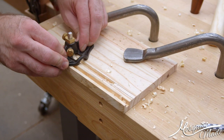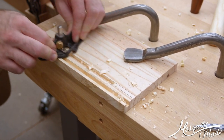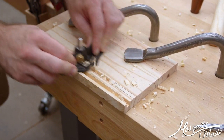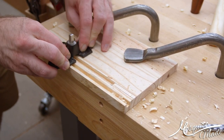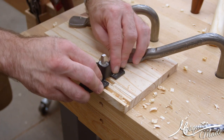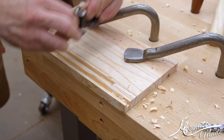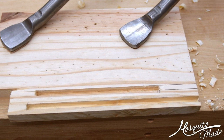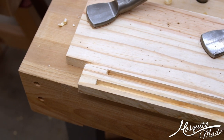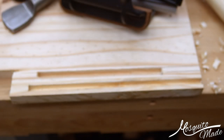Because you're cutting down into both ends, there's going to be a little hump in the middle — you can just take that out with the router plane, get it down to final depth, and get it all cleaned up. It works pretty well. It might not be an issue with a longer groove, because you might be able to get the plane down into the groove earlier and not have that same hump. But with this shorter, probably around 6-inch groove, I had to. Anyway, that covers a stopped groove with one side open, one side closed, and where both sides are closed. Hopefully that helped at least the one guy that asked. Thanks for watching.